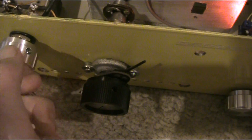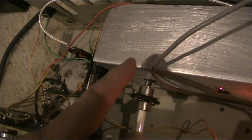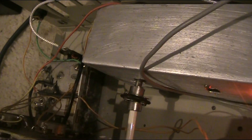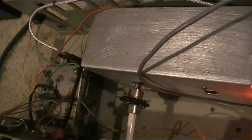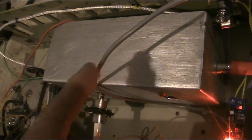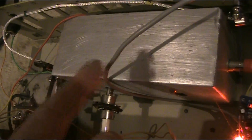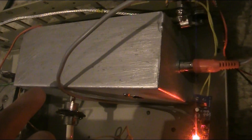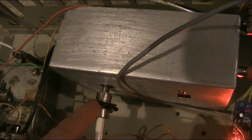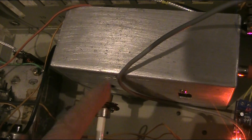Just there, that was the aircraft band. This is the TV tuner and here is the One Transistor Super Regen receiver. Eventually I want to add more parts to it so that the quench oscillation is done with an external oscillator, and maybe also a noise gate to give it a squelch effect. But for now it's just a One Transistor tunable IF, tuning between about 20 and 50 MHz.